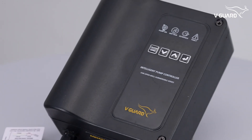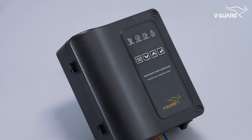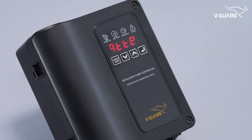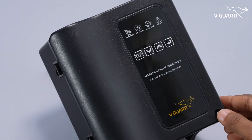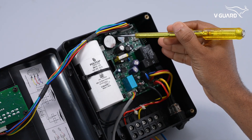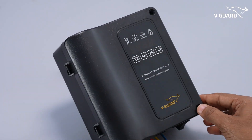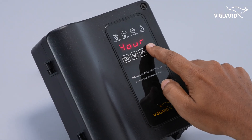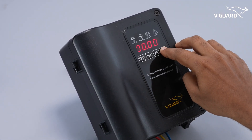The Intelligent Pump Controller can also help diagnose other issues. A low battery indication means the real-time clock's battery has a low charge. Replace it with a 3V lithium CR2032 battery to resolve this issue. After replacing the battery, 'R' will be displayed — set the real-time clock to resolve this error.